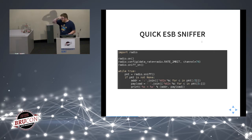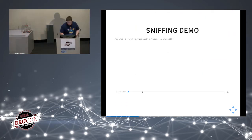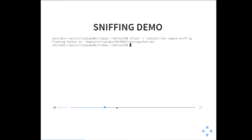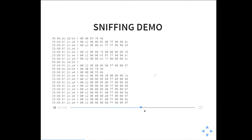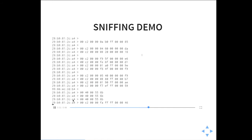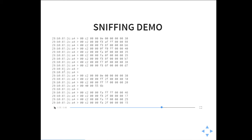In the basic loop, we just grab packets as they arrive — packets validated by CRC. If you program your micro:bit with my firmware and the correct Python code, you get data from a wireless mouse. This is my mouse — I'm moving it around and you can see all the packets sent from the mouse to the USB dongle. This is a Logitech mouse; it's easy to identify because all packets start with 0x00C2. So I can sniff all of this information.